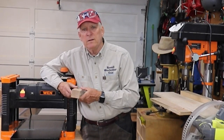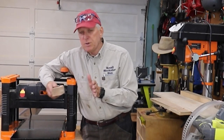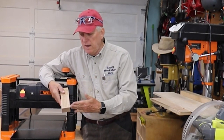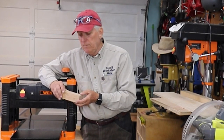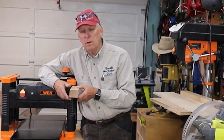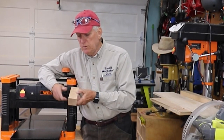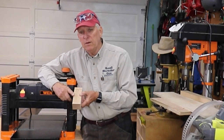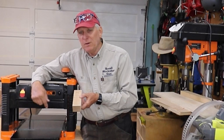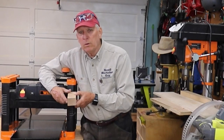I went back and looked at his video later and found out that I did a lot of things wrong. I put my sacrificial pieces with two-sided tape next to my work piece so I wouldn't get snipe on the work piece. But he actually put his sacrificial item on the end of his work piece and made it longer. My primary mistake was the length — nothing should go into these jaws unless it's 15 inches in length so that it's underneath a roller at all times.